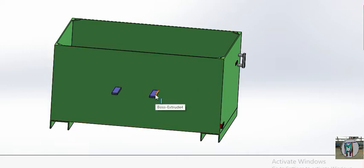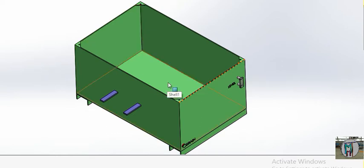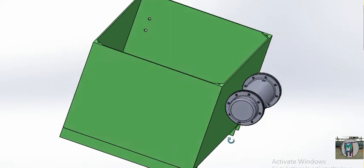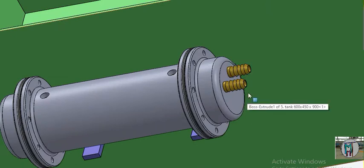We fill the oil from the top. There are two hooks for our hydraulic oil cooling system — the condenser. We will provide details about the condenser in our description. This is the hole for the cover which we will fix here. The condenser, or heat exchanger, has two holes where hydraulic oil enters and exits.